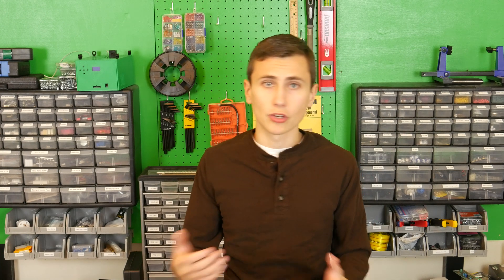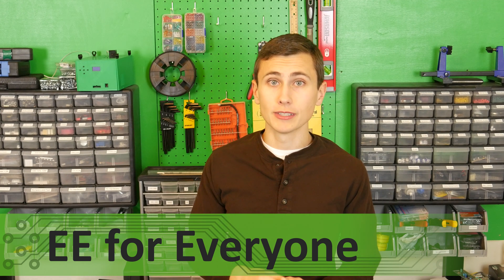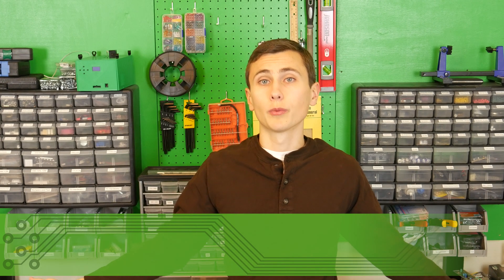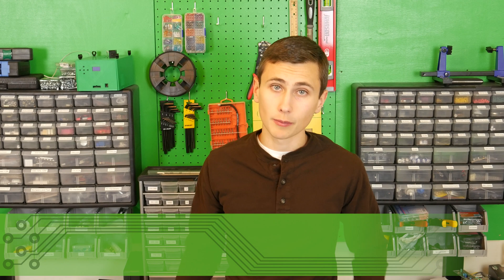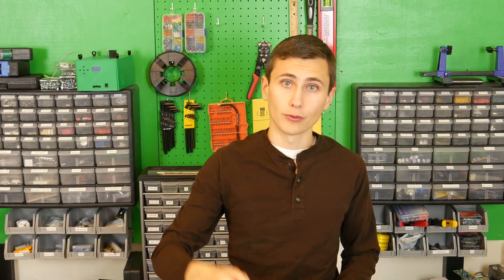I'm really excited for all of the features we plan to add to our inverter, and I hope that you are too. We have the framework set up to build a great UPS, capable of switching between power sources, running periodic self-tests, communicating with the outside world, and predicting battery failure based on charge and discharge performance — features that I hope exist in every UPS on the market. We have a clear path forward and a schematic captured with our design updates for Project Darwin, which means we're ready to move on to the layout. We've officially ended the proof-of-concept phase and we're on to the full development effort. Subscribe to be notified of future videos where we will upgrade our 3D printer to print our own transformer bobbins and prepare our design for automated PCB assembly. Thanks for watching at E for Everyone!